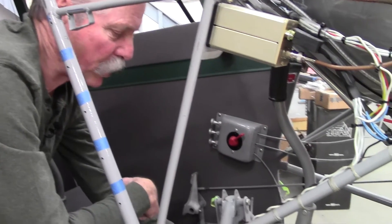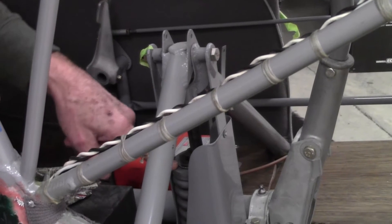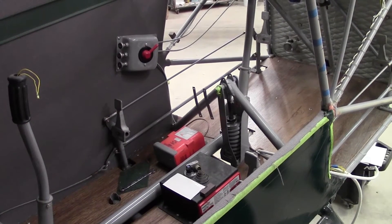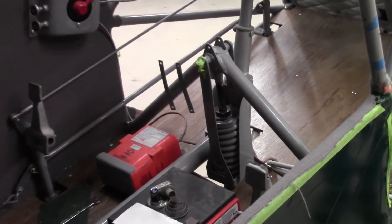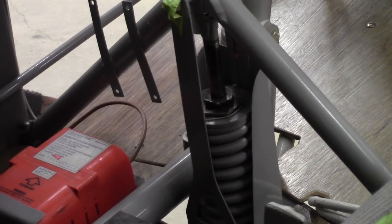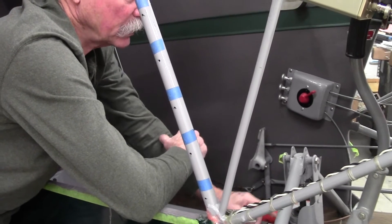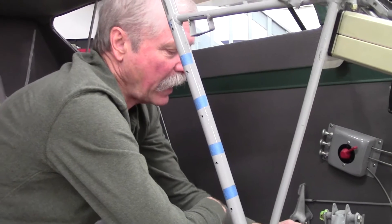The other item is the shock strut unit. A lot of questions come up about the shock strut unit — it is an oil spring unit. Typically with these, if they have been overhauled and then maintained appropriately for the life of the airplane, they will do well for many, many years. Mine has been in use for 35 years and shows no sign of wear and works perfectly.